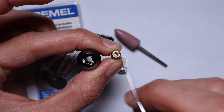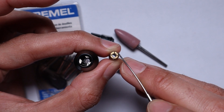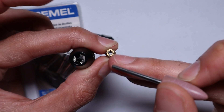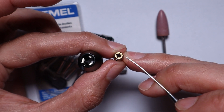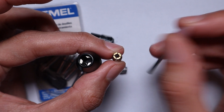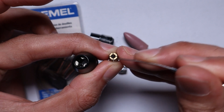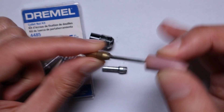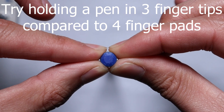So which one is better in terms of grip, precision, and strength? The collet is better. It's a more snug fit, it's got more contact surface all around the shank, much more even. You can tighten it to the point where it's really biting in. The brass ones I'm a big fan of because they don't damage your steel shanks - over time the brass will deform instead. This is more preferred in precision work. On a lot of CNC machines you'll notice they have collets perfectly sized for their tool. The wobble is also completely gone - with all that contact between collet and shank, there's no option for it to wobble.